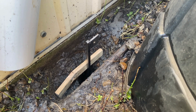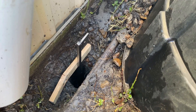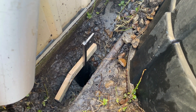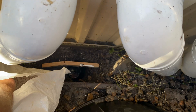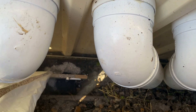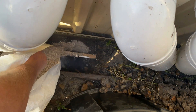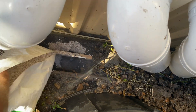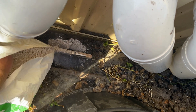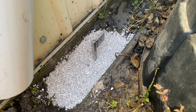I've driven the grounding electrode to the required depth. I'll put that little bit of timber there as a packer just to keep that electrode in place while I add the bentonite granules. I'll go and grab the bag now and fill that hole up. Just slowly add the granules so you don't get any air pockets, then flood that hole with water turning those granules to a paste. That makes the electrode nice and solid and gives a really good earth. I'll top that hole right up now with the granules.